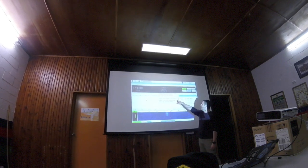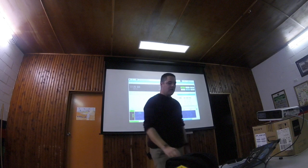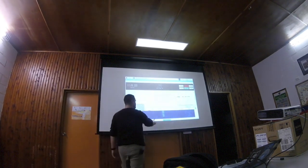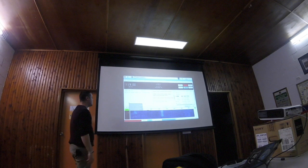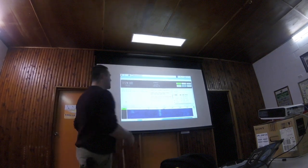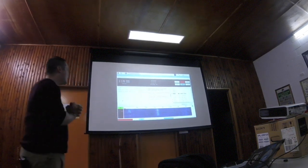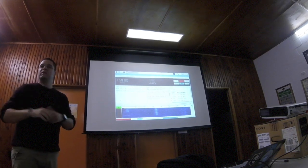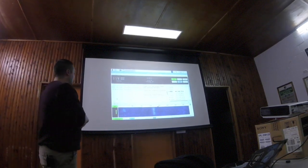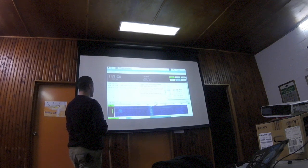So at the moment, I'll send out a heartbeat and we'll see who can hear us and who responds. This is one click. So as I said, it'll send it in the 15-second window, tells me it's transmitting, which is literally my call sign, heartbeat, and my heartbeat being HB, which just tells the network, I'm alive, I'm alive, I'm alive, and it can send it in increments of any N minute, whatever N minute you wish to have it. I suggest around 10. But so we've sent out ours, and I'm going to be looking for any activity coming in here very shortly that'll be responses from automatic stations. He says, don't you love a good live demo that possibly doesn't go how you want it to?